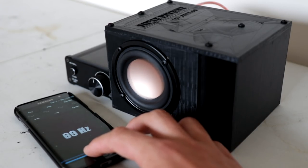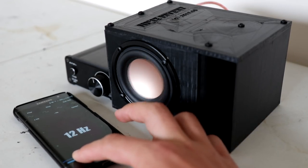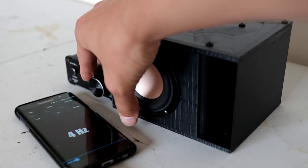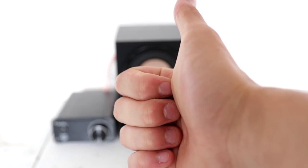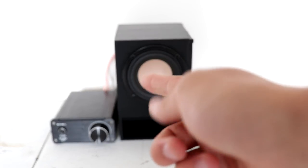180Hz is absolutely ridiculous resonance. It sort of drops off around 280Hz. So the box has some very funny characteristics as far as what frequencies it likes to resonate at. For the price and what it is — a 3D printed speaker box — this thing doesn't sound too bad, however it's definitely not the best sounding speaker out there. But for a budget three-inch woofer and a 3D printed box, it's a pretty cool project. If you enjoyed this video, leave a like, subscribe to my channel, and I'll catch you in the next video.